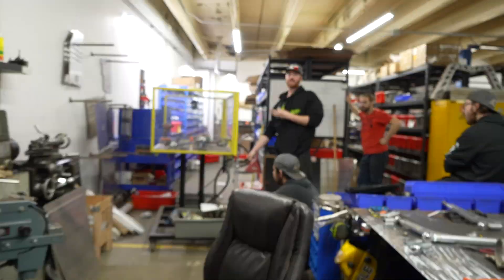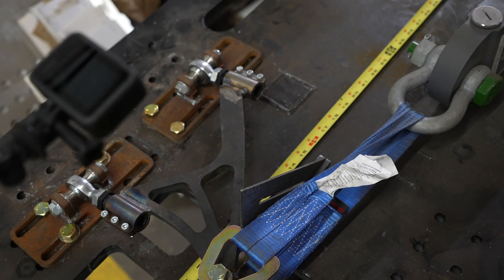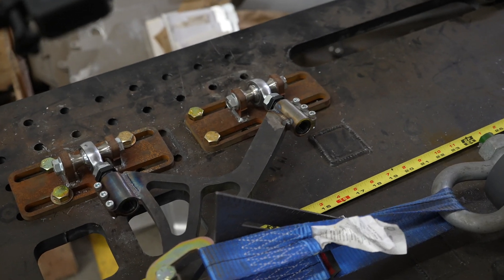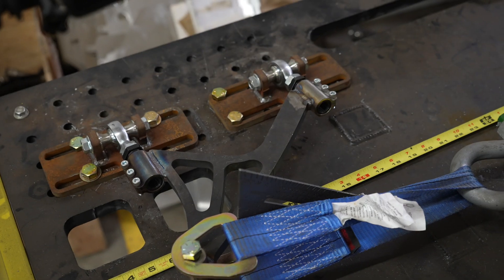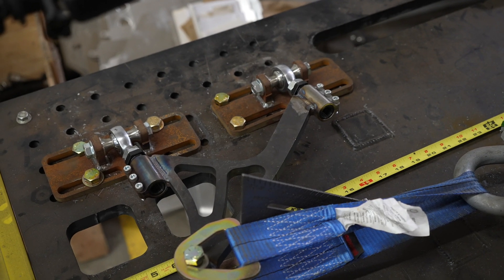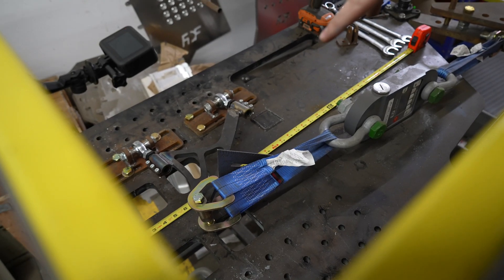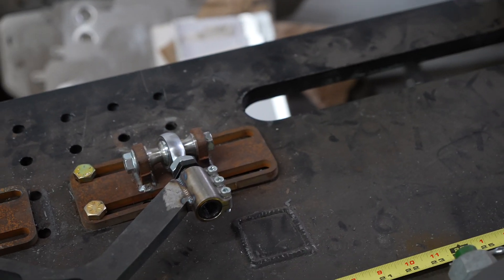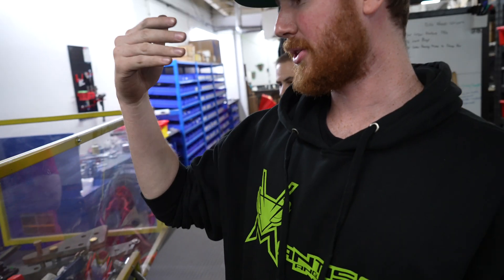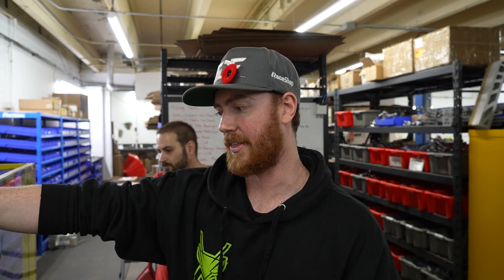I'm just going to let the pressure off and you'll see the arm. The plate on the right side of the arm is lifted completely off the table. Right now there's 6,000 pounds of pressure on that end and it's lifting the plate, the mounting point. It's actually bent both of the adjusters. The majority of the pushing force is on that mount and we're almost pulling from the other one, so you're going to see that deflection on that front mount.